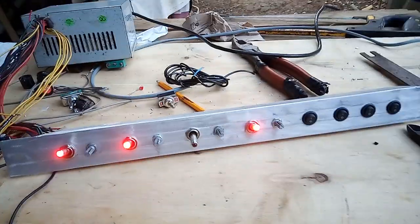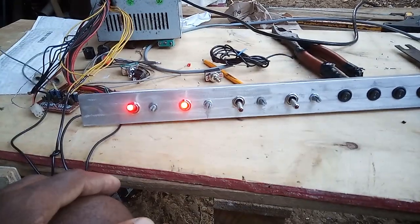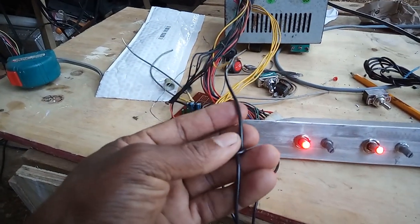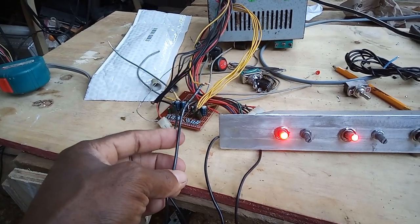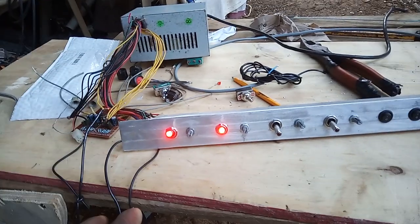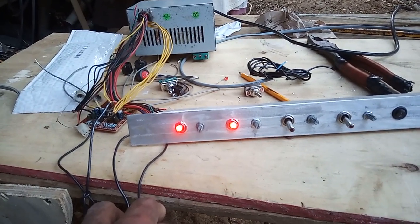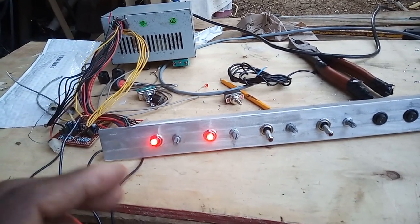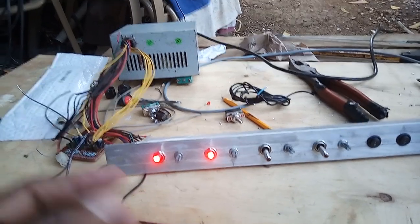And the tweeter also is not going to take a lot of pressure, but if the 12 volt is weak, that is the reason why I use a big wire, this big black wire here. I'm going to label it, put a red label on it to show that it is the remote positive. If the remote wire is too small and not bringing enough amperage to the amplifier remote, it's going to make the amplifier squeal. You're going to hear some squealing sound.